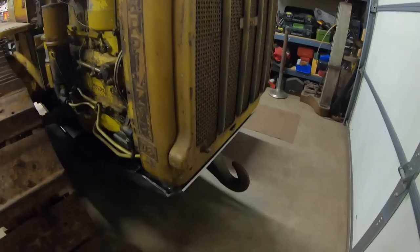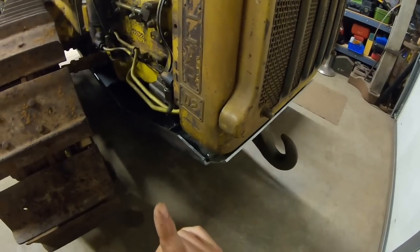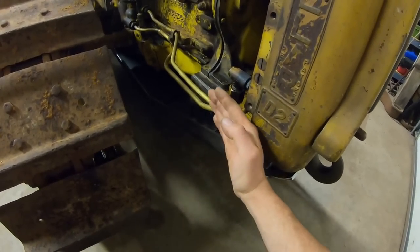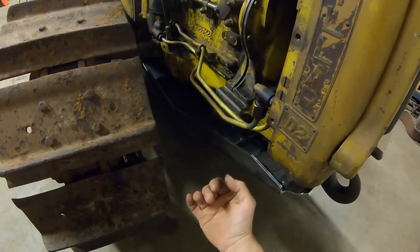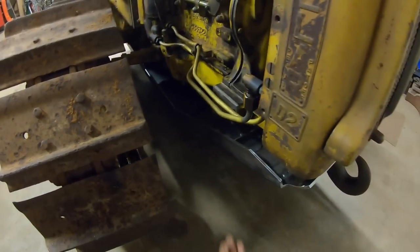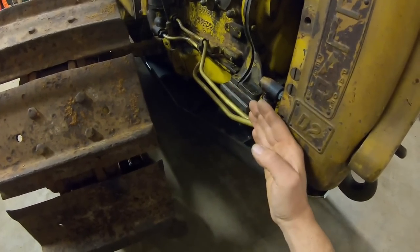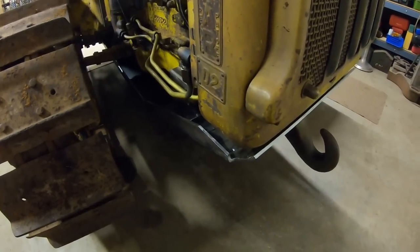That's not necessary in this case, but I like those rounded front bumpers, but even more so, the side iron brackets that facilitate those really go a long way toward protecting the side of the engine and radiator from the tracks or from foreign objects that the tracks will bring around, even more so with those super wide track pads that are going to be on this tractor. So that's probably the main reason I'd like that extra support that piggybacks on the outside of the side panels here, that extra protection in case we do run a track or have anything happen like that.